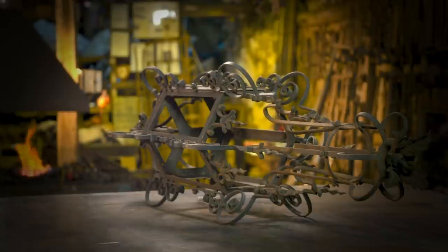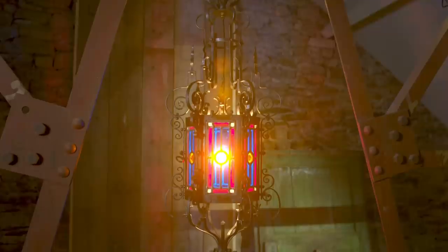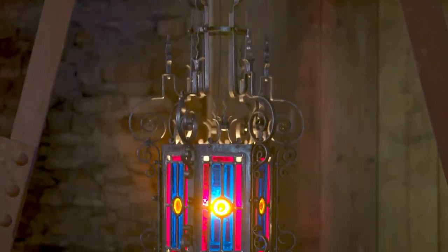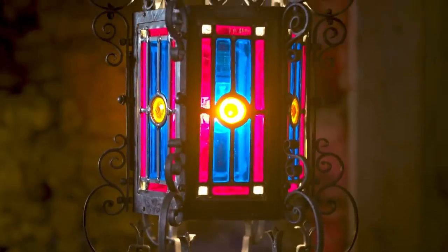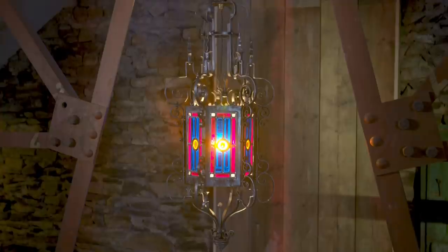When Drew brought it in, this hall lantern had been damaged in a fall. The fragile metalwork was bent, parts were broken, and the glass panes were almost completely missing. Nev has straightened it up, welded the breaks, hand-forged a missing finial, and reduced the height by two inches. Gordon has crafted bespoke leaded glass windows of traditional design that throw coloured light in all directions. You can really appreciate why these things were so popular and still are — when you saw it hanging in place, lit in a dark room, that's why people want them. For that elegance you get at night, and the visual impact during the day of just having this artwork hanging in your hallway. It worked then, and it works now.